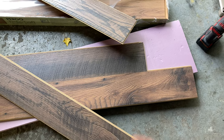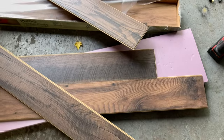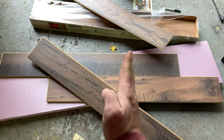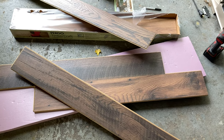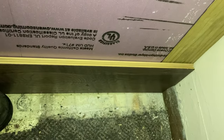This is what fake antique barn wood looks like. It's a lot cheaper than the real stuff, looks and feels like real wood, and you shouldn't have a bunch of weird gaps since it locks together nice and tight. I'm just going to cut the first piece on every row some arbitrary length to make it look somewhat less uniform, a little more authentic. You can see I cut the tongue off one side, but not the bottom, because I'm just going to put molding on the floor anyway. These planks are hefty and I want the load stacked vertically, so the 2x4s and nails' only job is to keep them from falling over. Two nails into each stud on both sides gives me a nice sturdy board.